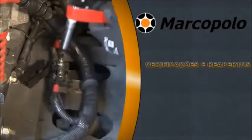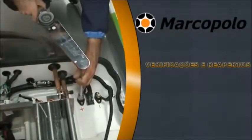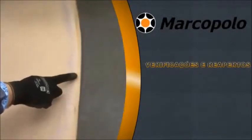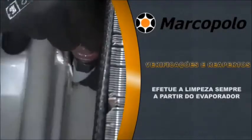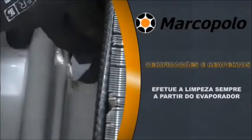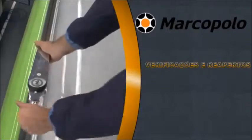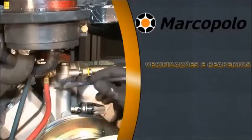Open the fuse box and check the fuse connections. Retighten nuts using a torque wrench to apply the recommended torque if required. Check the connections in the rooftop unit and retighten if required — this check will reduce breakdowns. Check the rubber sealing on the unit and covering for good condition. Use compressed air and a special elbow to clean the drain pipe from the unit side. Close the cover and retighten all cover bolts using a torque wrench. Check for leakage on the compressor and fitting connections using soapy water.